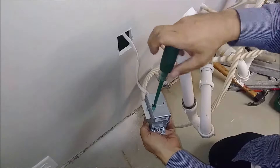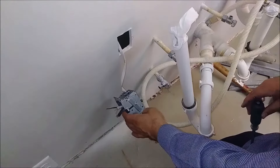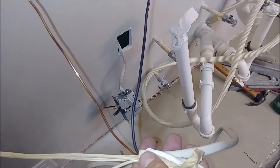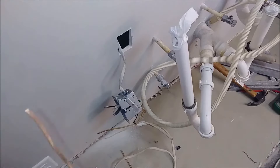I'm going to screw it here and have a copper wire going from here to this hole for the ground. Here I have a leftover cable that I don't need. You can see this is the ground — I'm going to cut the ground to about this length and use this cable as a ground. What I want to do is ground the box — it's very important. That's why we bought this metal box: to ground it. If there is any water or moisture and a risky situation develops on the box, it will ground it and save your life.